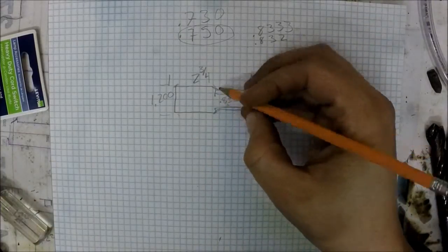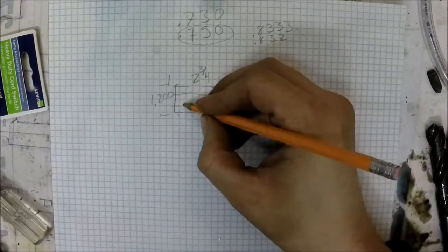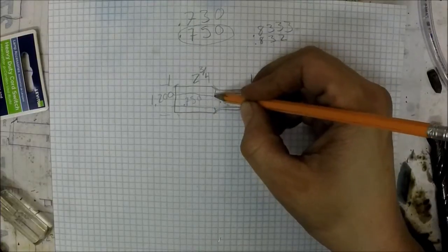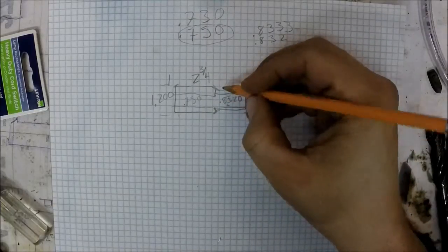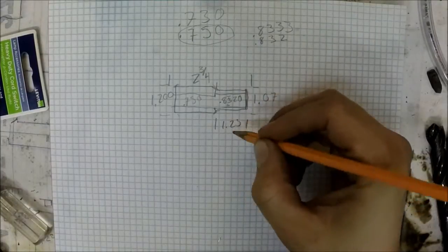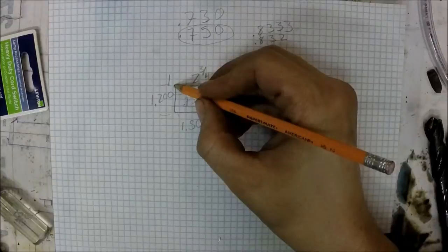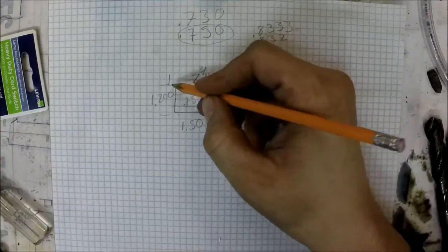There'll be a tiny little shoulder, and then this section here will be just over 750 thousandths. And that way, when the barrel comes in, it registers against this shoulder. I have 1.25 inches. I'll do that here. Inch and a quarter there, and this I have 1.5 inches. Now these chamfers end up being about 1/8 of an inch wide, so there's not going to be anything in the chamfered section.